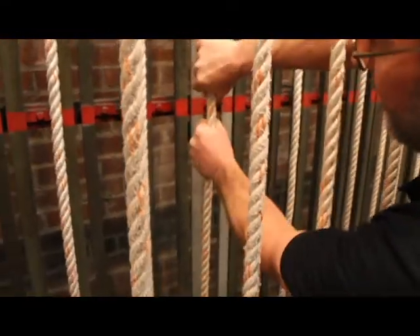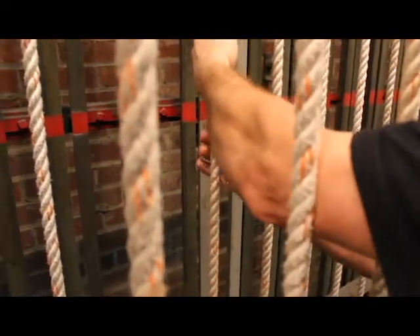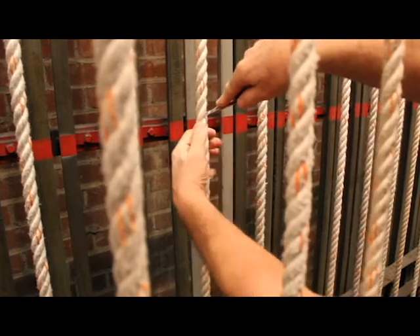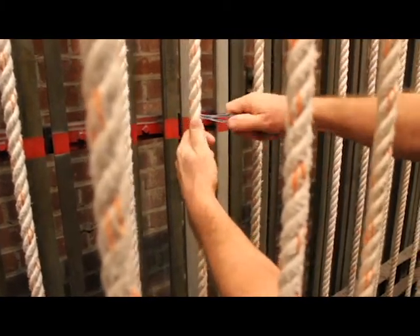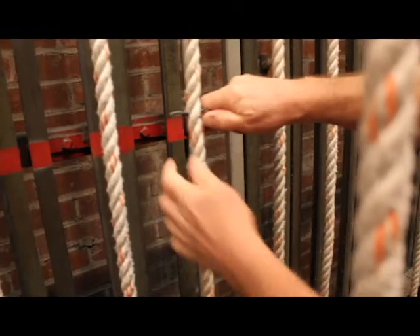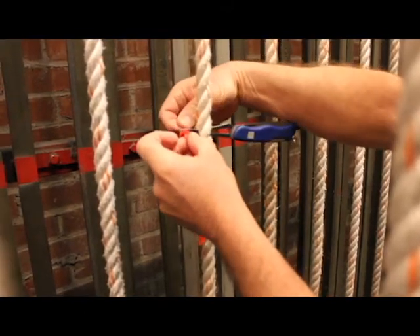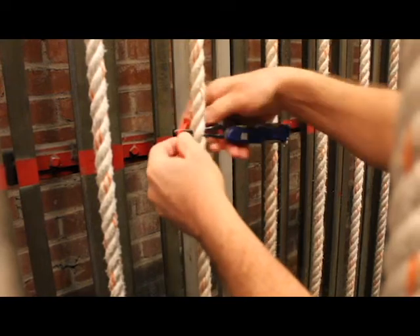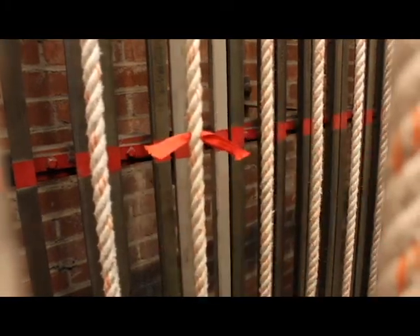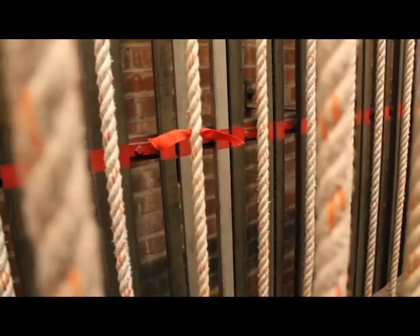I'm going to do the same thing back here on the back line. I can't twist it very much because the whole rope twists back here, so it's more a matter of having fairly easy access and being able to see it. Work the spike in between the strands, put the point of the ribbon through the tool, pull an inch or so through, and then pull the ribbon back through the rope. Now that red ribbon on the back line lines up with the red line on the T-rail — that's the high trim.